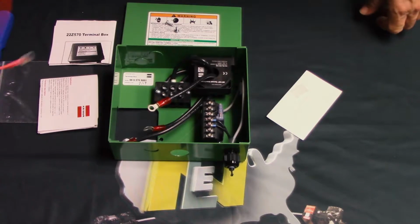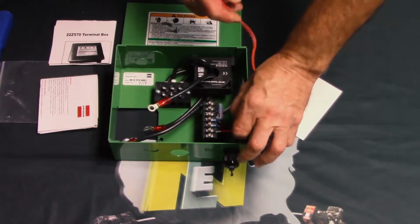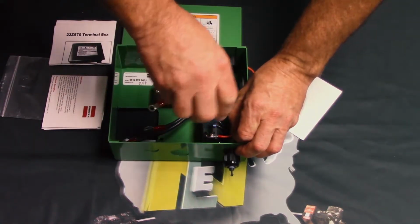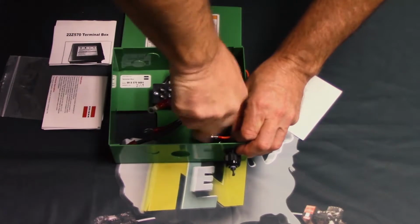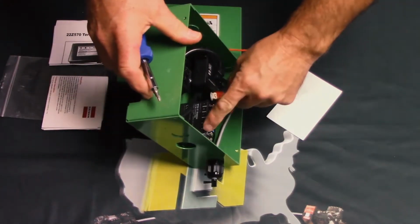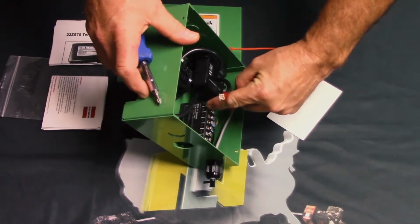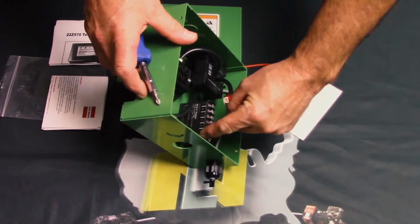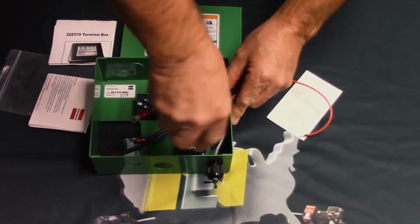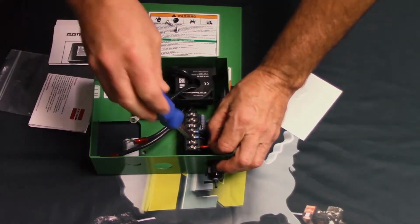What's going to happen is you're going to take one of these orange wires that you've removed. You're going to simply attach it down here. We'll use number 14. And if you're not sure where these terminals are, the numbers on the terminals reside right here on the side where you can see this. You can clearly see the numbers. You have L, N, 1, 2, 3, 14, and 11. So 14 and 11 are the two that we're going to use for hooking up to a bimetallic thermostat.